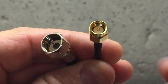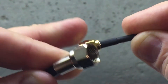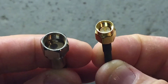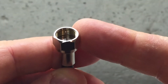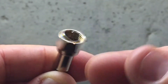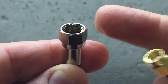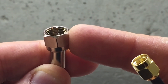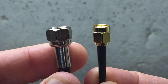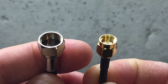In the video, I mentioned I was surprised about the smaller connector that comes with the MLA loop versus what I thought it was. This is actually an SMA connector. The other one is called an F-type connector, typically used in coax connections in houses for cable box and TV — it is not SMA. The RTL-SDR V3 dongle comes with this SMA connector, so that's why it's going to fit.